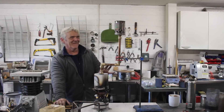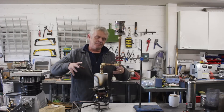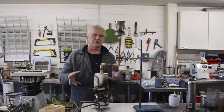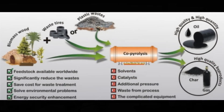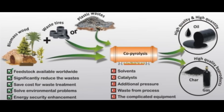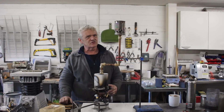That was pretty cool! This procedure is not only the second part of gasification — it can also be used for making petrol out of plastics. It's exactly the same procedure: you put your plastic in there, give it heat without oxygen, and it breaks down the same way that wood does. But it won't leave charcoal behind — what's in there after wood is just ordinary charcoal briquettes.